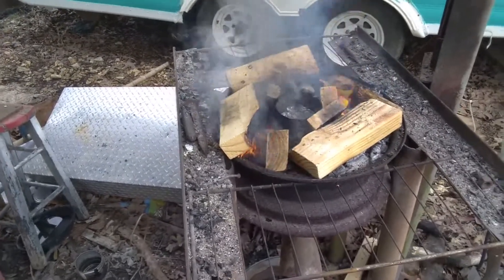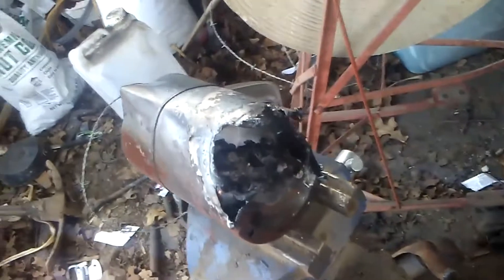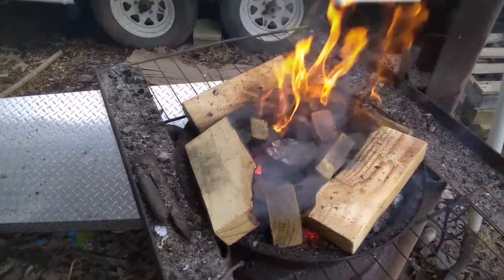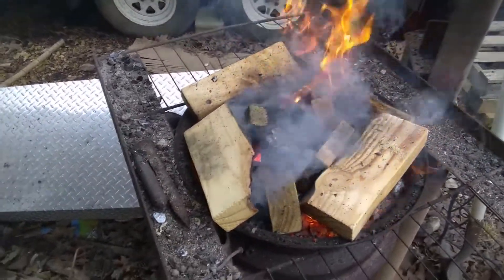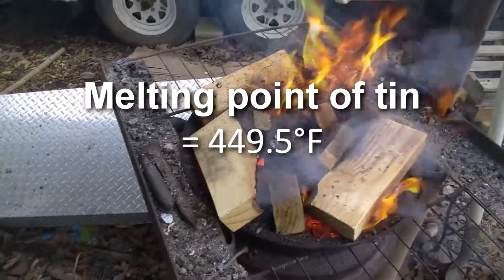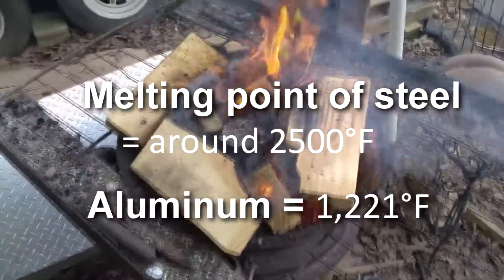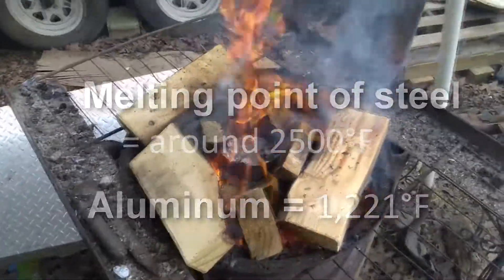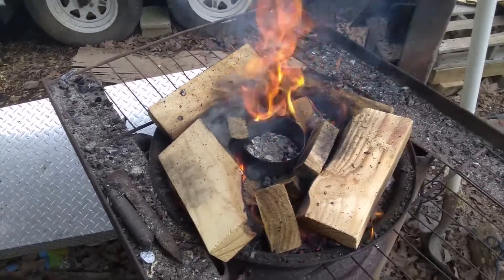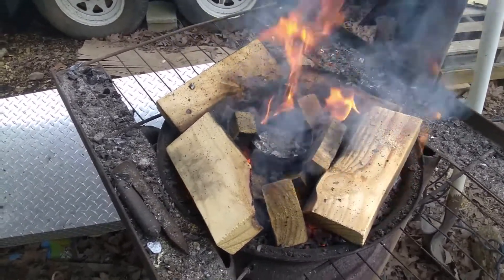I also feel I should say the end result isn't a good crucible — it just worked. For a crucible of about the same caliber, you can just use an old soup or vegetable can. Tin has a low melting point, which would be a problem, except the cans we call tin cans are actually made of steel, so they have a higher melting point than aluminum. As long as you keep your temperature low, you don't have to go through all the work of making a crucible out of a propane tank.